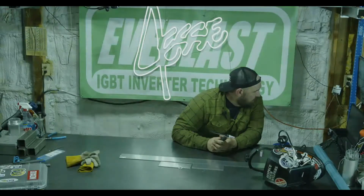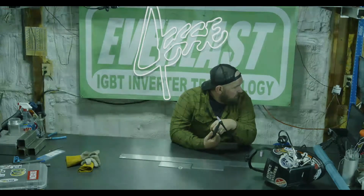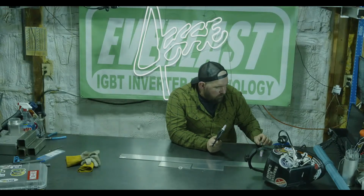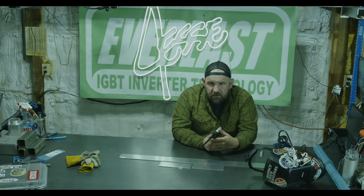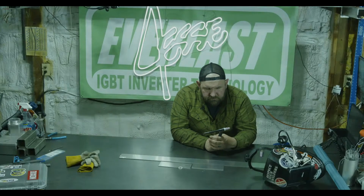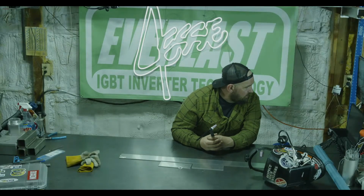Last week's conversation about torches and some of the weird cups got me thinking. We did that video on the Everlast page. If you go back and look, we did a cup video showing a number 5 standard, like I've got here, which I don't run very often, and then going to a 5 gas lens and showing the differences between them and how they react to gas flow. Originally, we wanted to do that video with a number 5 standard and a number 6 standard with a number 5 and number 6 gas lens, but just doing the number 5s, the video was already like 15 minutes long. We ended up running a number 18 and showing how you can make that work at like 60 CFH.